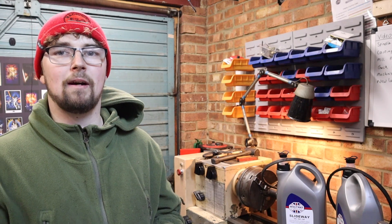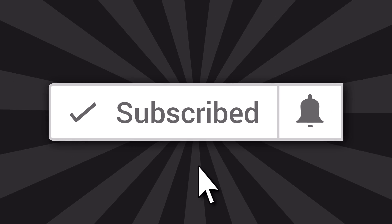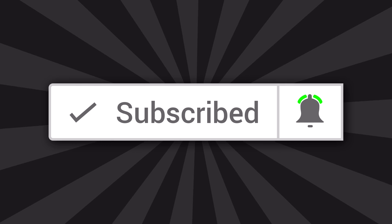In this video it's a little bit more advanced because I want to service this lathe. I don't know how old the oil is in there and the belts are in really poor condition. The video today is going to be about changing all the fluids, changing the belts, and probably giving the chuck a good service because there's a lot of brass swarf in there. If you've got one of these or a Colchester or something similar, watch this video — you might find it useful.